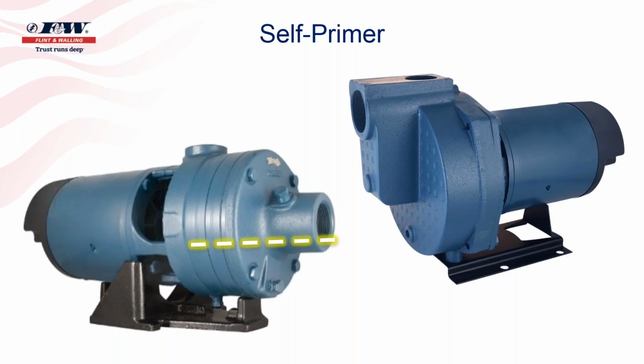Where the self-priming pump, and the way to identify a self-priming pump or a lawn sprinkling pump from a straight centrifugal, is that that inlet will always be higher, much higher than dead center. So the notion that a self-priming pump, the reason they come up with the term self-priming touches on something we've already said, which is an impeller cannot move air.